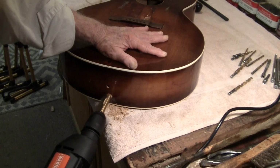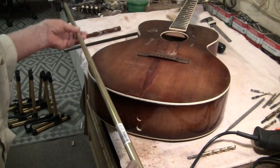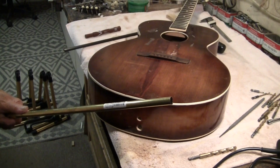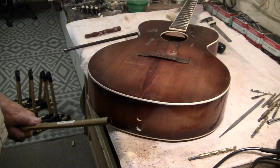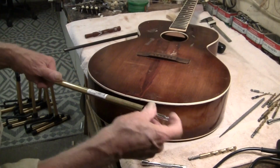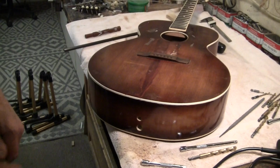Very nice. And so this is 17/32 OD. This is part of tubing sold as telescoping tubing. The ID is going to be about a 1/2 inch, I think. 7/16, I don't know. Anyway, I'm going to be using it as a guide for these 1/4 inch drive extensions, and it'll allow me to put them together and give them an exact, stable direction to move in. I hope.